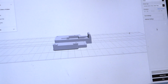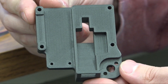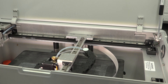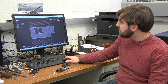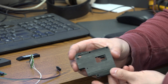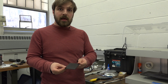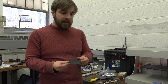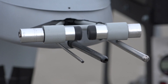When we import the part, we can make various decisions about whether we want it to be hollow or have a solid fill, decide how thick we want each of the layers to be, and all of that goes into determining how quickly the part prints and how strong it will be when used in the aircraft. Our 3D printer prints only in a nylon base material, and this black material has been infused with bits of carbon fiber. This came in particularly handy on the UAV project — in the MetFlux payload, the hygrometer mount was actually printed on this printer. It's a large probe that sticks out the nose of the vehicle, so we wanted to make it as rigid as possible, and filling it with carbon fiber helped to do that.